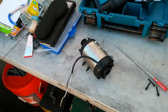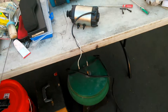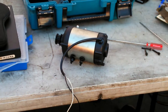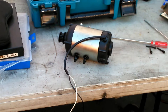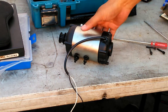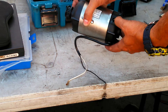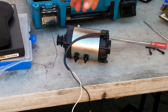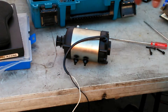So now I've got the motor on the workbench. What I'm going to do is replace the brushes in the motor. But before I replace the brushes, I'm going to clean off the commutator - the piece on the end where the brushes make contact. I'm going to remove the stator and then clean the commutator where the brushes make contact.